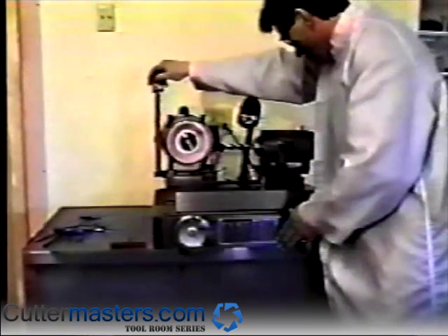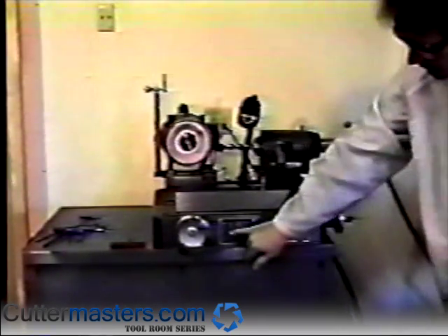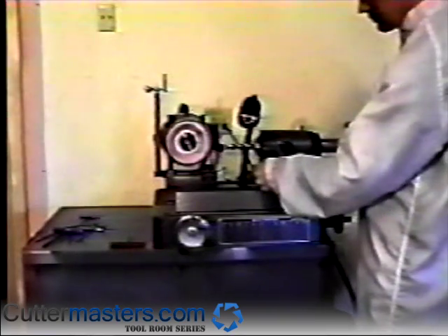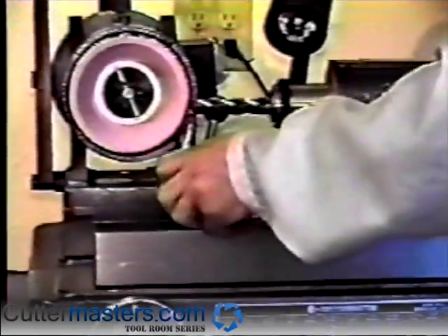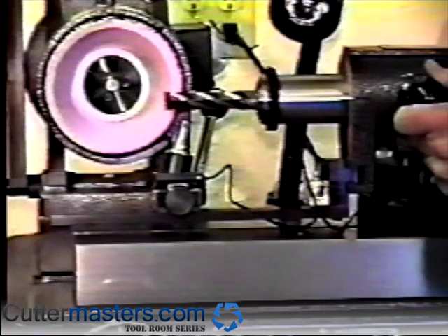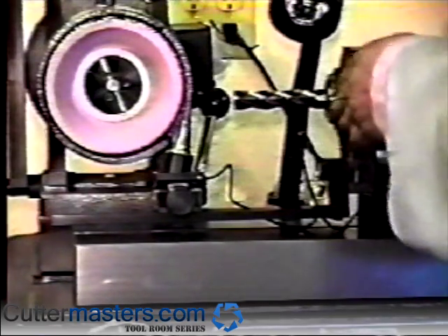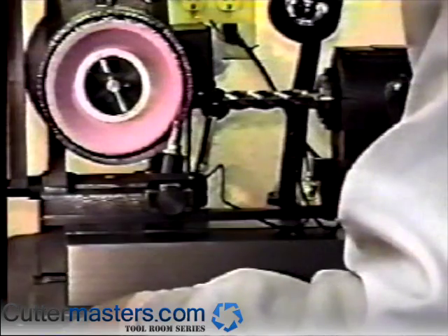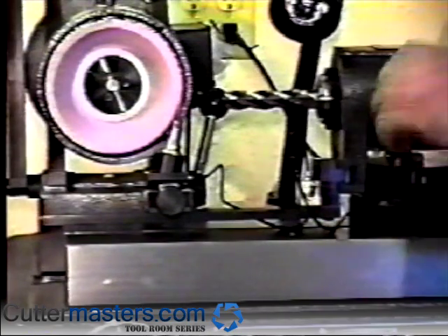With the motor left at zero and using the pneumatic finger, the tools will be ground to the same clearance as shown on the chart. With the switch in the up position, dial the knob until the stylus rests underneath the flute you are sharpening. Position the stylus at the right edge of the wheel as done before, and proceed to sharpen your primary angles.